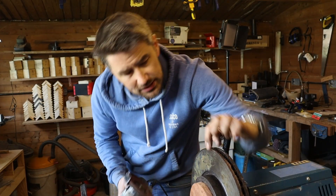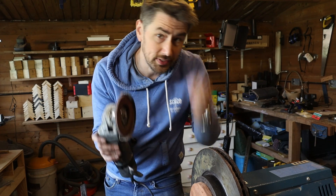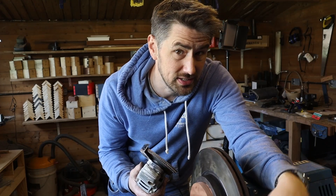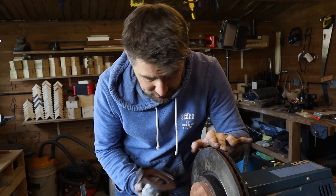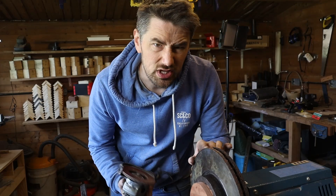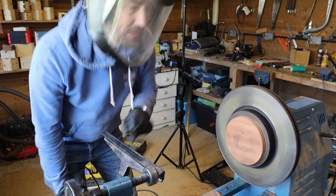The first thing I'm going to try to get this lip off is a flap disc sander on the angle grinder. This is an 80 grit wheel and first of all I think I'm just going to go very light touch, just taking the rust off and seeing if I can get this lip off the edge. If it's not strong enough I've got a 40 grit and I've also got a few tricks up my sleeve — we'll try this first. Right, ears on, face on, gloves on, let's go — I think I'll have to give this a bit of a spin to get it going.